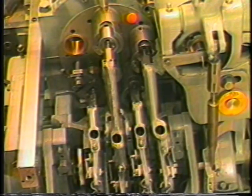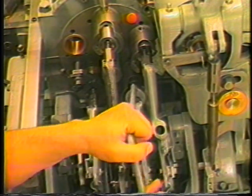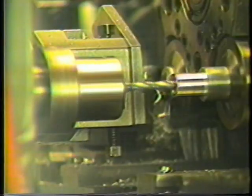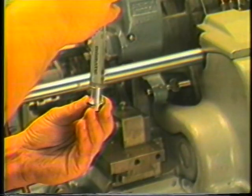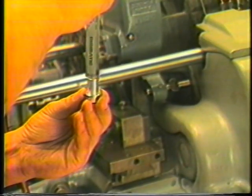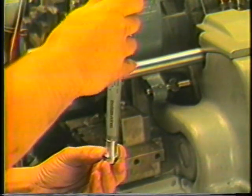It will be necessary to advance the drill with the turnbuckle until the drill is approximately ten thousandths of an inch from the workpiece. Drill the workpiece, then advance the workpiece to the fifth position where it may be severed from the bar. Gauge the hole for both depth and diameter. If the drilled hole is too deep, make the appropriate adjustment using the turnbuckle.